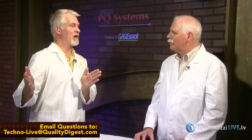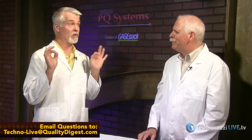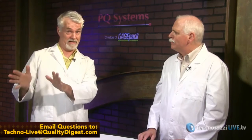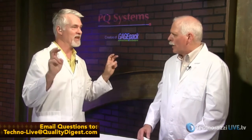We're going to say 20 to 1,000, and you'll never have an accuracy problem. Yeah, and then that way we can have a really nice accuracy spec where we may lose some of that accuracy. And again, I'm not saying this is true for Instron, but for some equipment, if you start going outside that range, even though you're capable of doing it, it won't look as nice on the spec sheet. We see that a lot in pressure gauges, in torque wrenches. They're designed to be used mid-range.